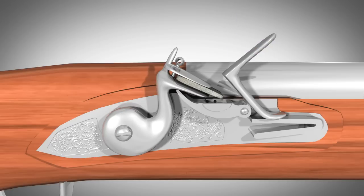The flint needs to move at high speed to strike the steel in such a way that sparks will fall into some gunpowder. The main parts of the flintlock are the hammer, which holds and accelerates a piece of flint; the frizzen, which is a piece of steel that the flint strikes; and the pan, which is the place where a small quantity of gunpowder waits to receive the sparks.